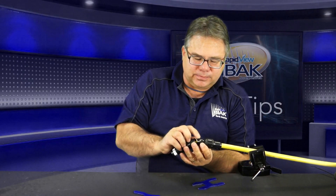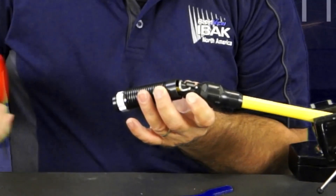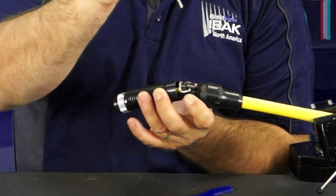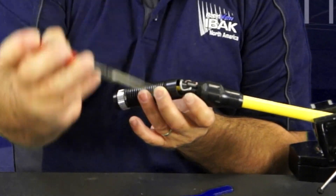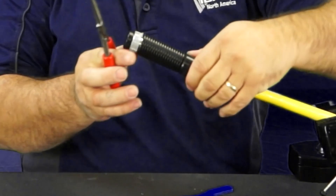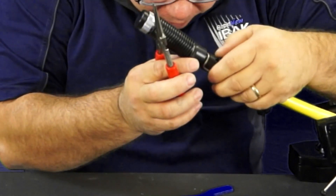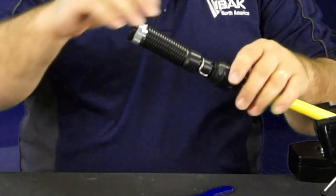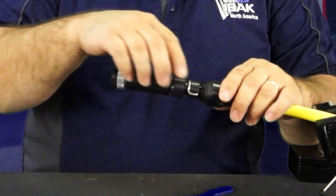There's a plastic sliding piece. Everything is all black and it's kind of hard to see, but you move this back about five millimeters and pull out the small parallel pins. There are two of these in the coupling — make sure you take them both out. If you don't take them out, it won't allow the inner assembly to free spin.